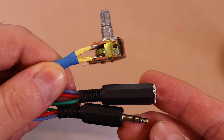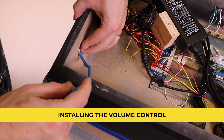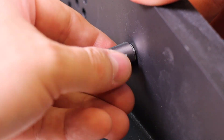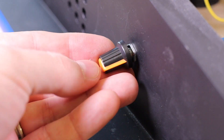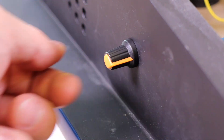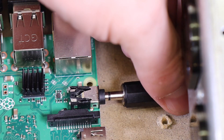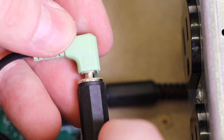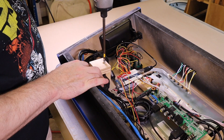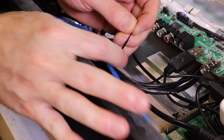That completes the cable — let's install it. I'll have a complete wiring diagram for this on geekpub.com. We'll insert the stereo potentiometer into the cavity that we drilled out earlier and hold it in place with a quarter inch nut. I found this really cool looking volume knob on Amazon. We'll disconnect the speakers from the Raspberry Pi and connect the input of our potentiometer, then plug the speakers into the output jack. We'll drop the monitor's power supply back in place, screw it back down, and zip tie the volume control's cable in place for safekeeping.